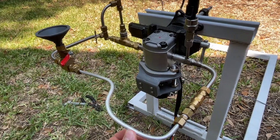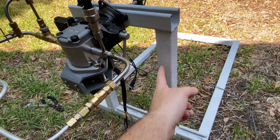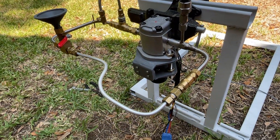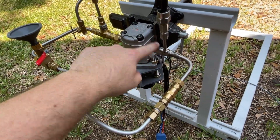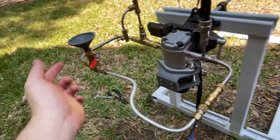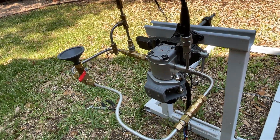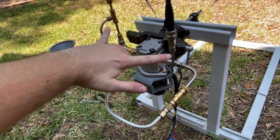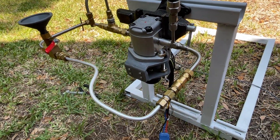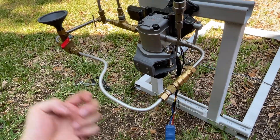In this test setup I just have it clamped to my test stand that I'm building. This is the outlet side and this is the suction end. I bled the whole line with kerosene, pouring it through this funnel, and then have a high point bleed here. There are pressure transducers up and downstream of the pump, and it basically just recirculates through.